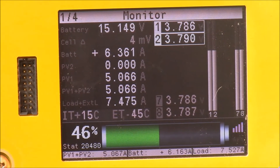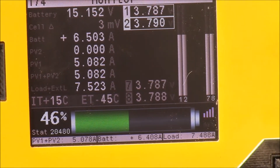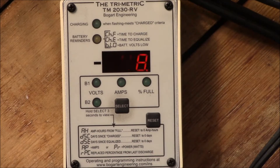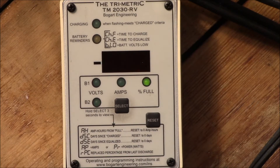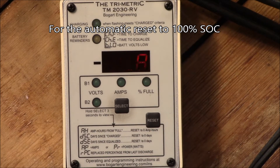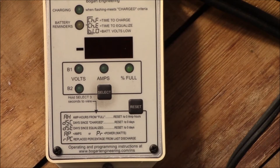Good morning YouTube. This is the SBMS 120 display and we're at 46% state of charge. The Trimetric is getting 48%, so these two are pretty close. With 170 amp hours, they're within 2%, which is about 3.4 amp hours. This meter only takes into account the amp hours in and out of the battery since it was fully charged, so I might need to do a little more adjusting on the parameters. I just wanted to show you the two meters are reading pretty close to each other — that's probably about as close as you can expect.